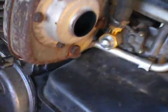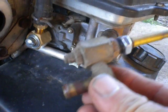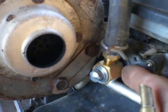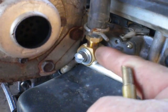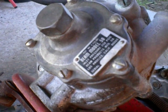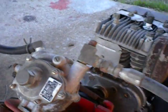This is a little one I've been working on just recently — a real cheap setup. What I did was took a Honda spud end, cut it down, beveled it right at the end, and screwed it right into the side of the diaphragm plate on a Honda 5 horsepower engine. Put a bolt on each side and a couple of O-rings. Came over here to a zero pressure regulator — that's actually a Beam Model 50. It's a good regulator, but it doesn't have a primer button. It's probably good for 65 horsepower or so.